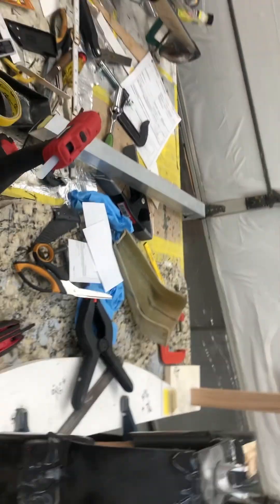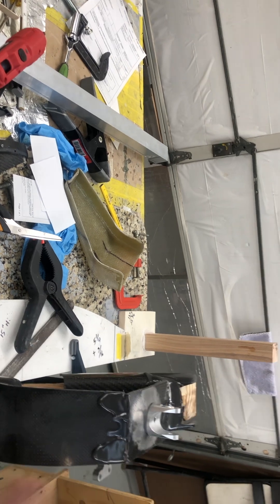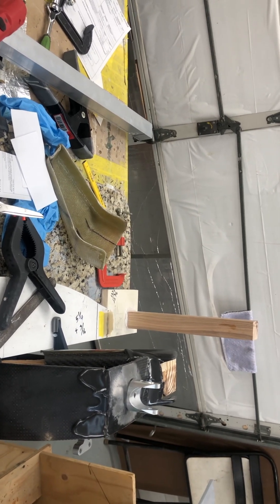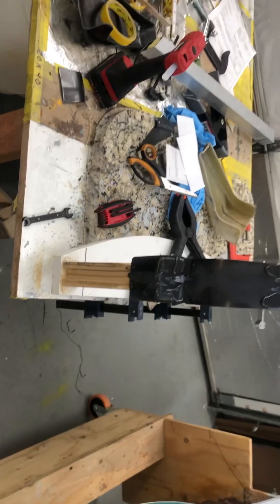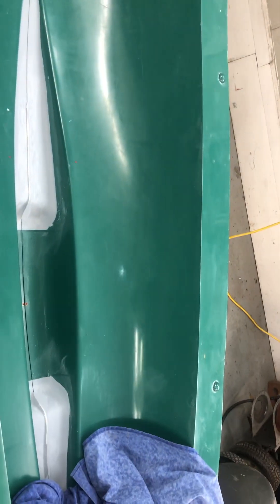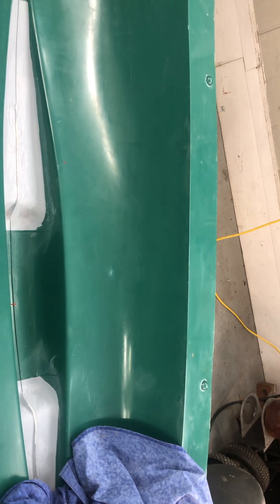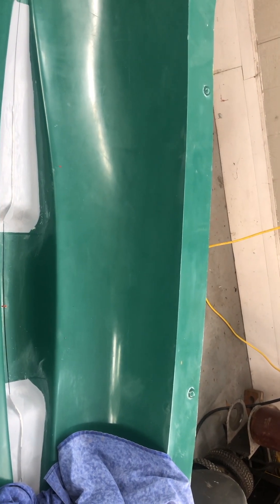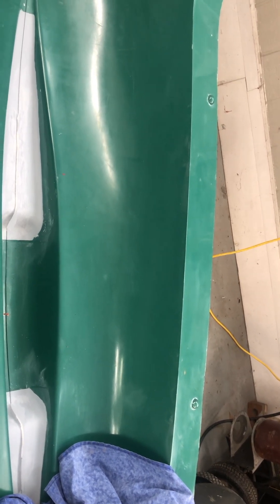This plug — I'll pull a two-part mold off of it that bolts together. I'll build a fence all the way through here to the front; the mold will bolt together down through there. It's a two-part mold — you turn it upside down, lay the carbon in upside down, then the next day you unbolt it, split the molds, and take your part out. The part goes in here as one piece from there to there, all at once with DuPont U-428 — I think DuPont bought them out.